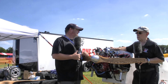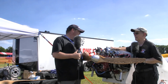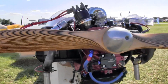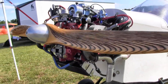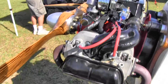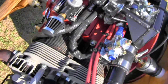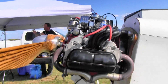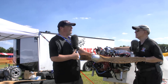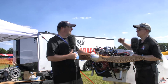When we talked earlier I asked you about horsepower and you said you prefer to talk torque versus horsepower — give me the short story on that. A lot of guys will tell you their Volkswagens have 65 horsepower, but you can't put a 72-inch prop on a Volkswagen and swing it like you can in a 65. It's all about torque, and we've got proprietary camshafts on the market now that make more torque. This engine right here is rated at 75 to 80 pounds of torque, which makes it appropriate for the light aircraft market — single-place aircraft under 700 pounds flying weight.